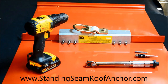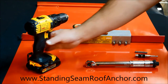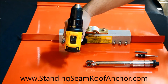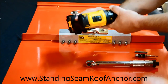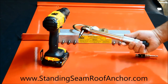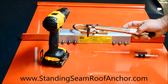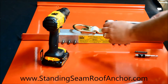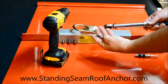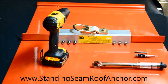So once you've done all that, you really just need two tools to install this. You need your typical screw gun. Hopefully your screw gun has a clutch, which comes in handy and certainly helps speed up the installation. And then you also need a torque wrench, what they call a micro torque wrench, that is capable of reading down into inch pounds. This is a 1/4 inch drive, and with this I have a 1/4 inch socket bit with a 3/16 inch hex. That'll just be used for the final torquing.